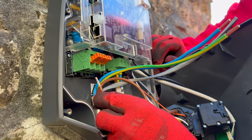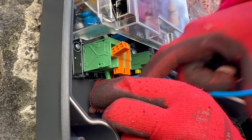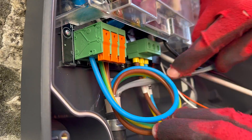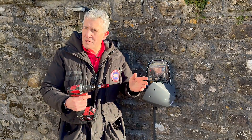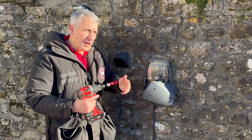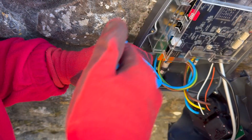Inside there's bags of wiring room and it's easy to wire in with these screwless terminals. For data connection there are two options: Wi-Fi, or wired. We're quite a distance from the router here, so we've played it safe and wired in the Cat5 cable as part of the EV Ultra combined cable.